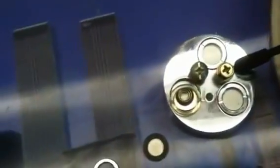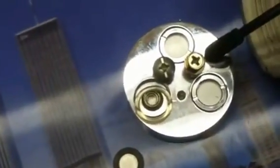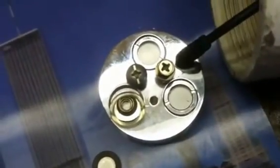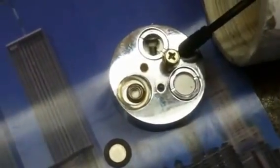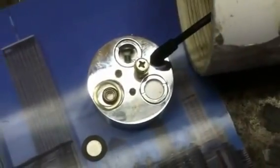I just wanted to show you how to modify a transducer and maybe keep it a little safer. Some people don't do much with the holes, but I'm always afraid about gas leaking down into the transducer. I don't know what's in there, and I'm not going to cut one in half to find out because that's $75. And the taps I use — you want to use a tap with the flat part, not the pointy one on the right, because you can go down a little farther with the threads. So that's about it for today, and I'll get this together next week and start her up again. Have a nice day and have fun!